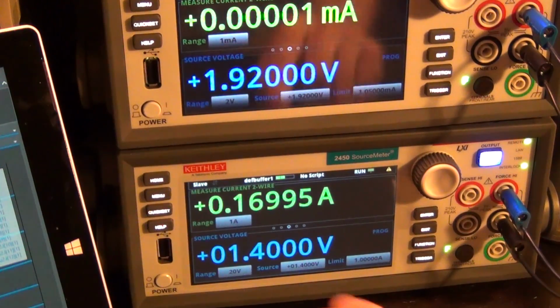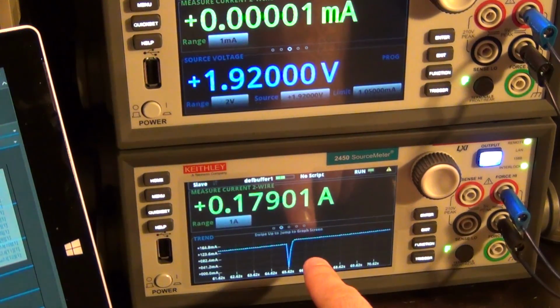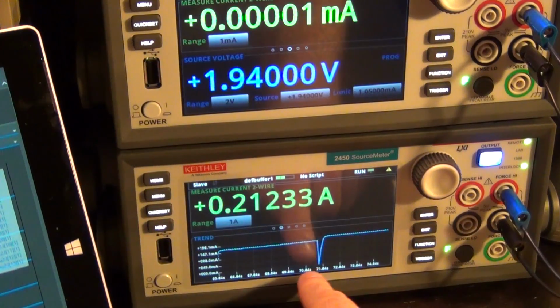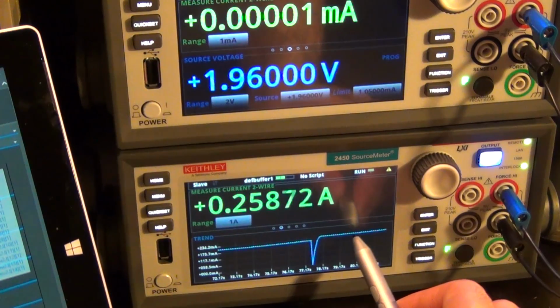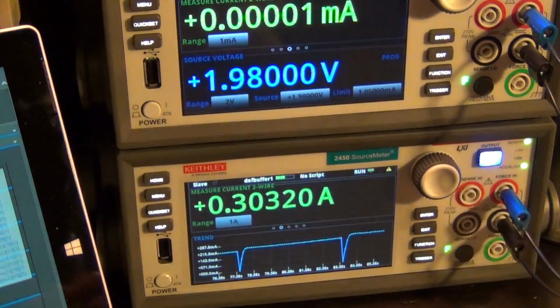And even here, if I sweep to the left, you can see directly what happens in between each of the sweeps. So the bottom point here is when the VDS is 0. You can even see it right here. So the device is in triode region, active region, triode region, active region, and it's going to continue to do that as a function of different gate to source voltages.